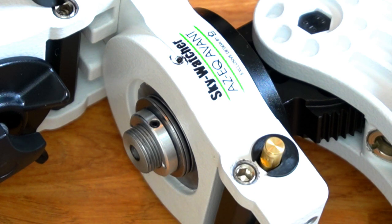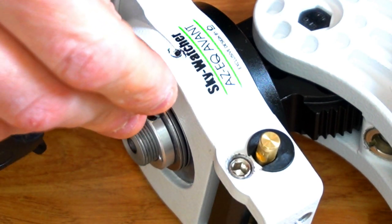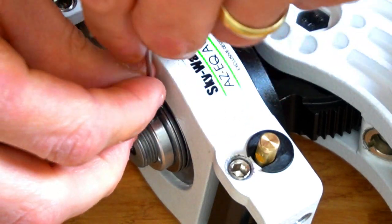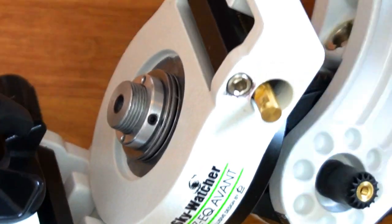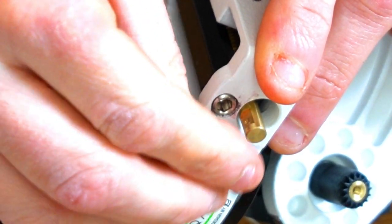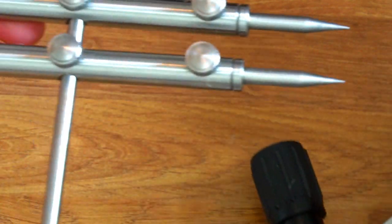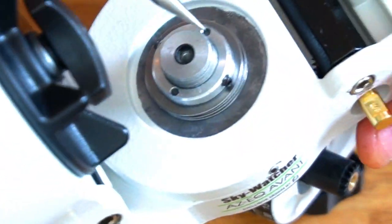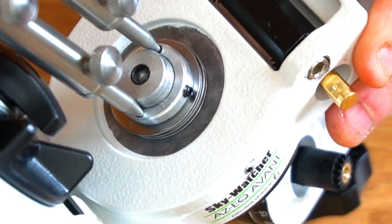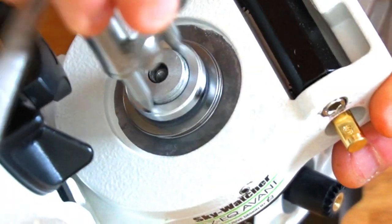Now at the spindle side, you see a lock screw. Here you've got two of these Allen screws, so we need to slacken both Allen keys. I'm going to turn it round to the next one. Okay, so that's both Allen keys loosened. Then get your tool from Rother Valley Optics, which is this. You're going to place the tool in between the holes and then you crack them off like so. Okay, you just crack it off, right?